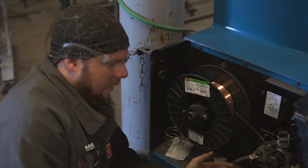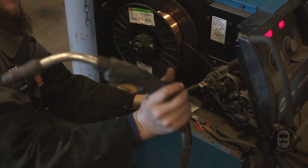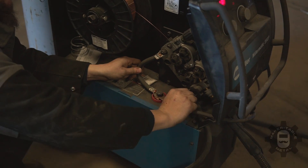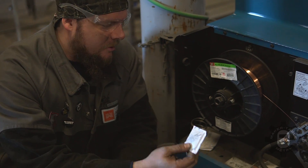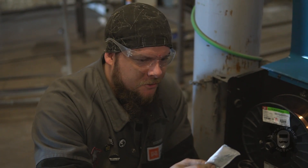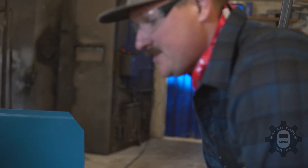For solid wire MIG welding, you've got your machine set to DC electrode positive — that's your hot wire coming in from your gun, and your ground connected through the lug. Step two is turning on your gas. In the shop I want this between 25 to 30. I always throw a little silica gel desiccant pack in with my wire, because all welding is a low hydrogen process and water is two parts hydrogen, one part oxygen — so you want to keep water out of your filler metals and out of your welding process entirely.